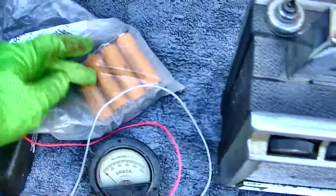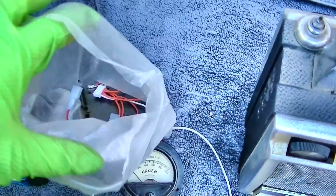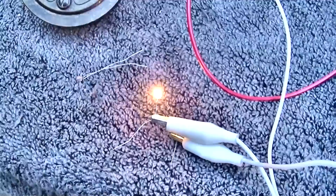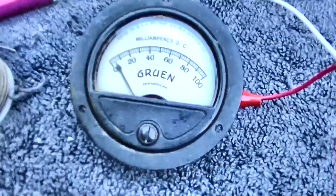I've got my lithium iron phosphate pack here, which is 3.3 volts per cell, so I could go 3, 6, 9. That looks like it's 6 volts at 90 milliamps. God, incandescent lamps are inefficient. This one looks like it's 9 volts at 75 milliamps. I'm just going by the brightness. This little itty bitty one is like 6 volts at, peg the meter. God, these things are hideous.